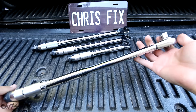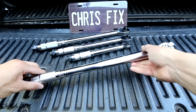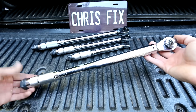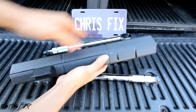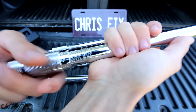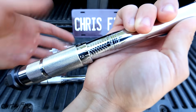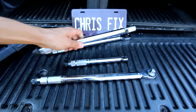The next top tip is taking care of your torque wrench so it lasts a long time. Make sure you don't drop this or impact it hard, because that could throw off the calibration. If you're constantly dropping it or you drop it from really high up, this is probably going to knock out the calibration. Also, you want to keep this dry and out of places it could get rusty. Most torque wrenches come in a case, so use it. The case protects it from moisture and shock. But before you put it in a case, you want to remember something. Inside this torque wrench is a spring which is under pressure. The more you tighten the torque wrench handle, the more pressure there is on the spring. When you store the torque wrench, you want to store it to the lowest setting. So loosen it up all the way, and once you get it all the way loose, tighten it a little bit past the lowest setting. That will keep slight tension on the spring so it's not completely loose, but the spring will be unloaded and it will make your wrench stay in calibration a lot longer.